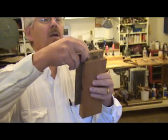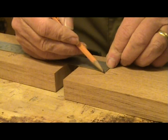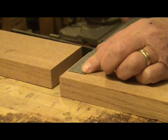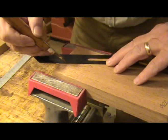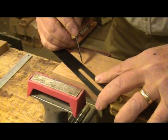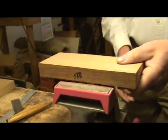It is important to make sure this cut is nice and square. Align the two pieces like they were before the cut. The length of the V is about 40mm — any longer and it can run into the tuner area. The width is between 34 and 38mm depending on how wide you want the neck; on this guitar Bill is using 36mm. Use a sliding bevel and a sharp knife to mark these lines on the peghead, then transfer these lines onto the other side using a square and sliding bevel.